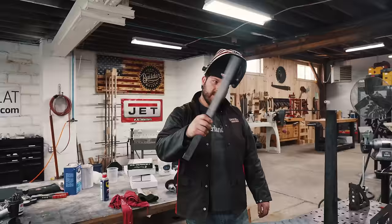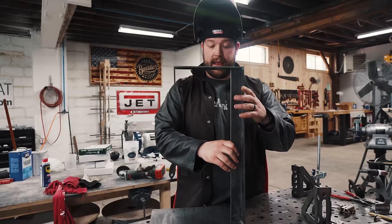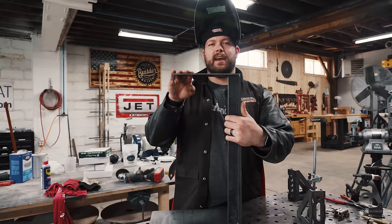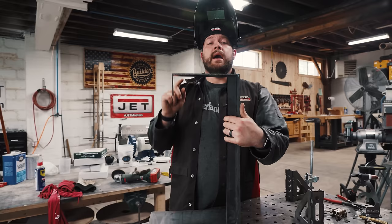Okay children, this is going to be the arm on the new table. We need to keep that thing from bouncing around like you saw there. So I'm going to add this spine down the center here — and you can see it already is way less bouncy. We're going to just stitch weld this in on either side and then we'll get to the shaping part of this.